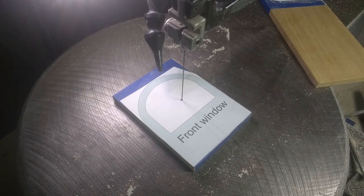Well, I've got the two halves of my floorboard drilling experiment glued, and all indicators are that it's going to work okay. I took my scratch awl and poked into those holes. It seems to be centered. Seems to want to kind of head straight down. But I'm going to let that dry and set completely so I won't have any problems with it when I try to drill it. And while that's gluing up, I'm going to try to cut the rest of these parts out.